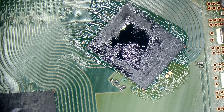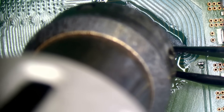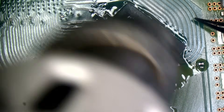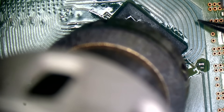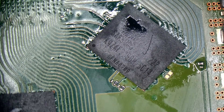All right, we are at air flow 10%, 440 degrees. I wasn't actually pressing on that — I was just tapping it to make sure it doesn't slide. There's a random solder bridge on the side of the chip — that was nice. Cool, soldered — good chip is good.